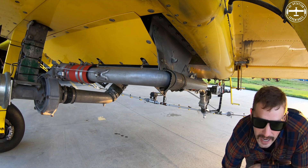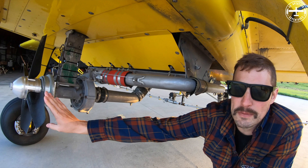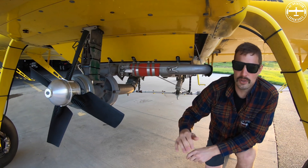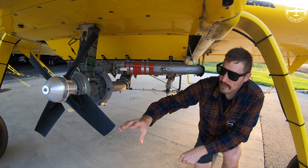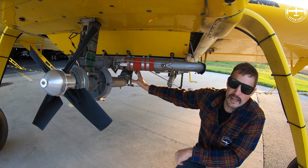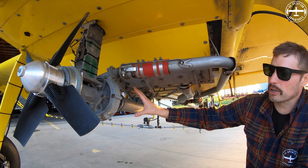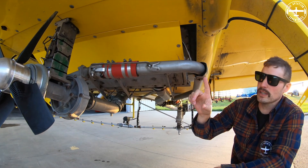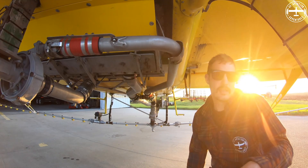Once it's full and ready to come out, I have this pump which is driven by air — it's actually just the airflow that comes by the airplane that spins because of the blades on it. Once that's spinning, that's what's building pressure inside the entire system. You can see the tube on the bottom here where the water and chemical come out, they enter this pump and then come down this tube which leads down to my booms.